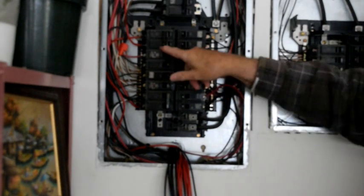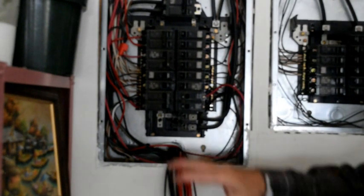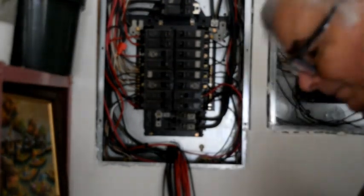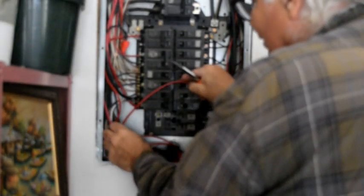I just have to repeat that for the other leg of this 220-volt circuit using the wires from circuit B. Sorry I had to stand in front of it, but there literally is no place to stand. Let's do circuit B now. The procedure is very simple: I'll loosen up the circuit breaker, pull out the wire, and set it aside. Get circuit B here, put it over here, get it to length.